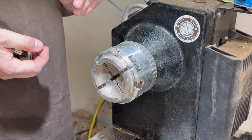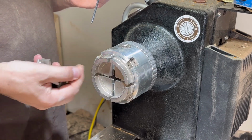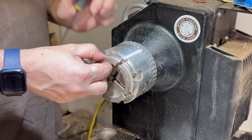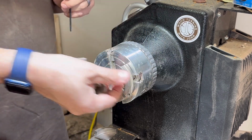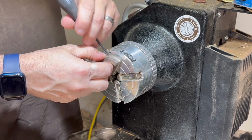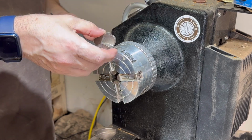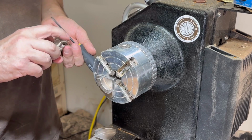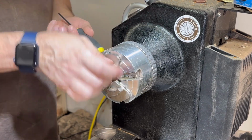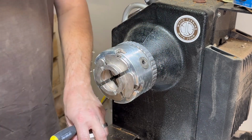I gotta swap out the jaws on this. I'm not sponsored by Easy Wood Tools, but this Easy Chuck is the best. I love that I don't have to do anything other than pop these jaws off and on for different sizes. And it doesn't matter which order they go in, like the Nova Chucks. They're numbered 1, 2, 3, 4. You just slide them on, it does not matter. And literally that quick, I've changed from 3-inch jaws to 2-inch jaws.